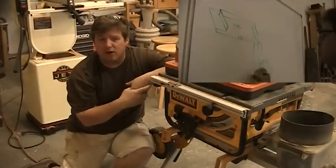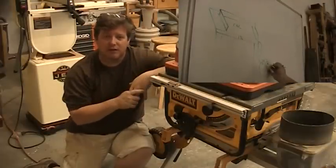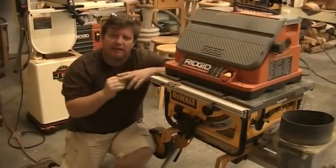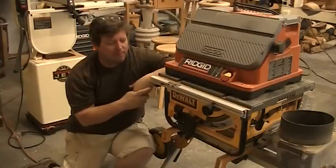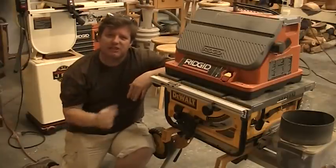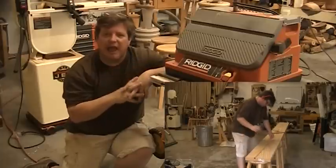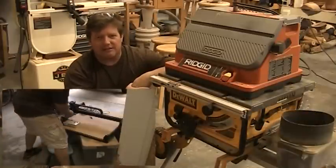The legs are going to be the first thing I need to build because they are going to be glued together and I need enough time for that glue to set. Since a 2x12 is about an inch and a half thick, by sandwiching two together I can get a nice three-inch square and it'll look nice and sturdy for me to push around the shop. So the first thing I need to do is cut out the center section of that 2x12 - the part with the cracks - to sandwich together at enough length to dimension it after the glue has dried, to get me four legs.